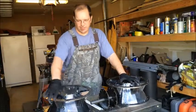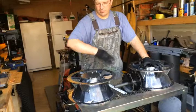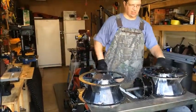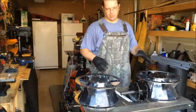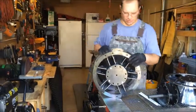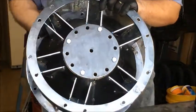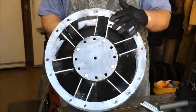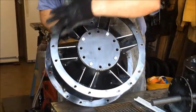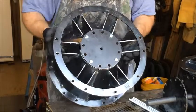But these are the two drive sprockets. Obviously the teeth — the actual sprocket portion of the drive sprocket — are not attached yet. That'll get bolted on at these locations on either side. The sprocket is actually a number of sections. It's all just tack welded together. You have the outer rims, a central cone, and then the arms.